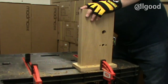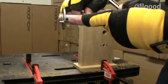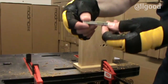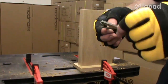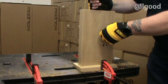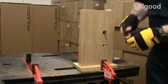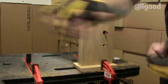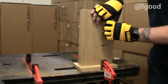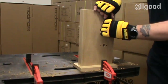While I'm at it, I might as well finalise the one on the other side. Next we fit the top spindle. Firstly, we orientate the handle — we can see the grub screw is horizontal, so we need the spindle with the groove horizontal, not top and bottom. We take the one with the pin at the bottom end, place it into the follower behind the lock and push down so it locks into place. Take the other section of the spindle, push it in on top and align your two holes. You can then replace the small screw and tighten those up nicely.